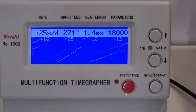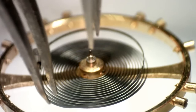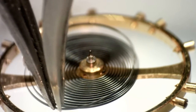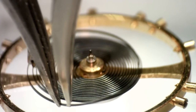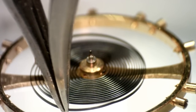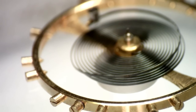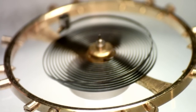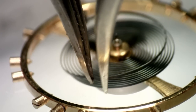I was not able to get the rate closer to zero than about 20–25 seconds, and the reason for that is that the overcoil curve was not entirely correct. The thing with Breguet overcoils is that the index pins catch on to the overcoil. If the overcoil curve doesn't fit perfectly in between the index pins, the hairspring will always touch one of the pins and that will make the watch go faster. The way to see how the overcoil should curve is to take the hairspring off the balance staff and put it on top of the balance cock — then you see which regular coil fits into the index pin gap. In this case that was the third coil.